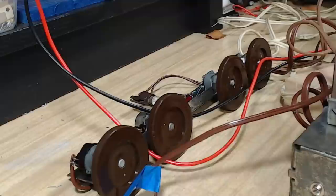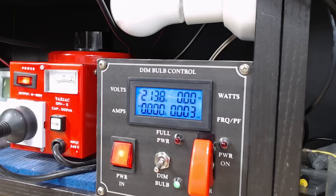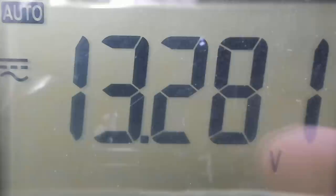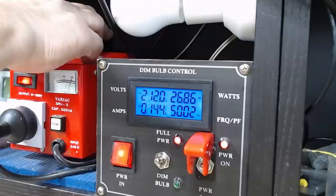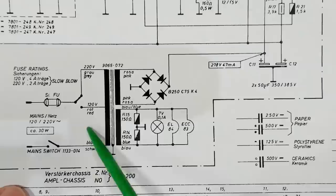I've changed the other three or four capacitors that needed changing and I've put the potentiometer back. I didn't need to do that potentiometer - I just kept working on it and eventually it came free, so they're both about the same. I've got it on dim bulb again. I will drop the power back a little because I've taken the selenium rectifier out and put a diode rectifier in - the voltage drop isn't anywhere near as much. I have my voltmeter measuring the output of the silicon rectifier. On full voltage I've got 268; I'll turn the voltage up a bit - and we've got 282. That's pretty close. So it's putting in about 212 volts to get the correct B+.